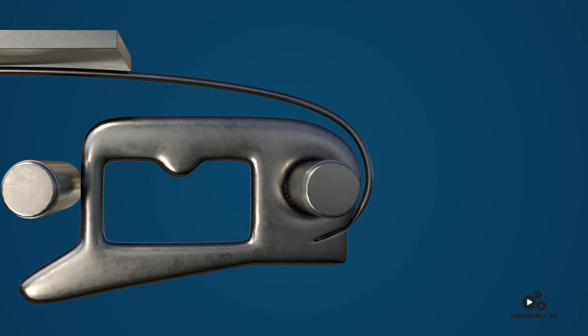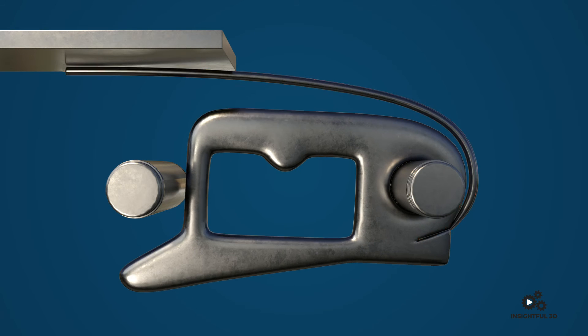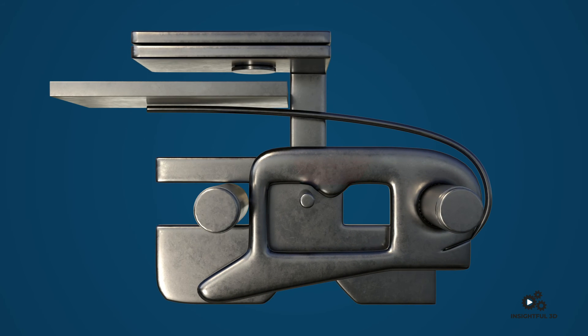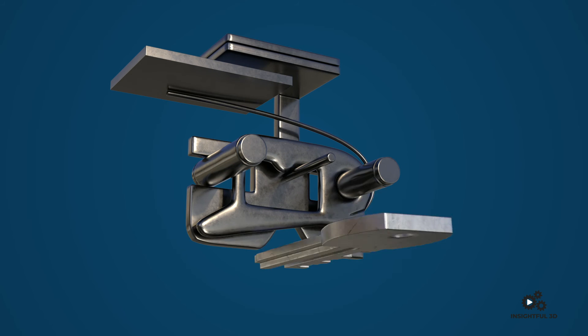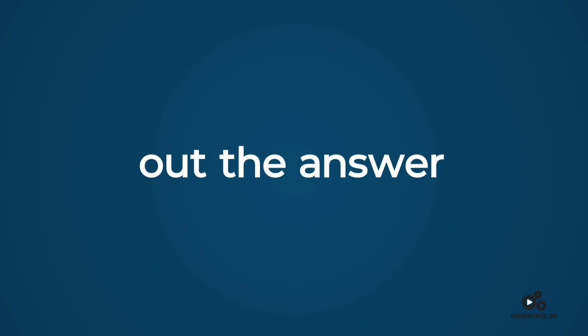A spring does the work of lifting the shackle. The levers rotate around a metal hub. The wire attached to each lever acts like a spring and provides a restraining force. This extended part prevents the rod of the main lever from moving to the other side. Turning the lever a certain amount with the key allows the rod to move from side to side and the lock opens.